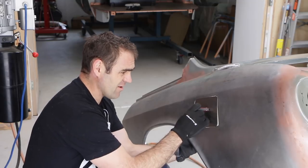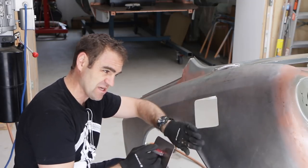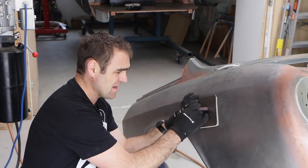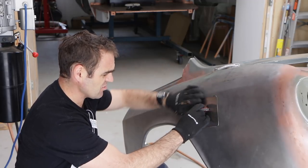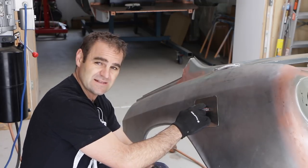I've got my plate — I've given it a few tweaks just bending it to match the very slight curve of this panel because it's not dead flat. And I've got a very nice flush fit. It feels nice all the way around, a nice tight gap so it's going to be nice to weld. Let's give it a go.